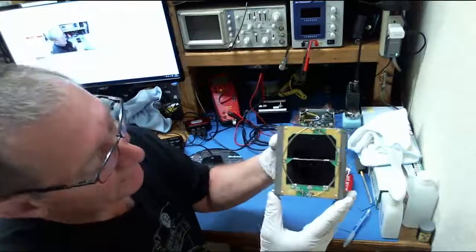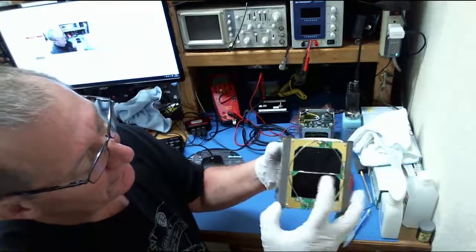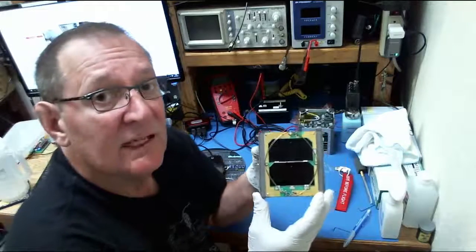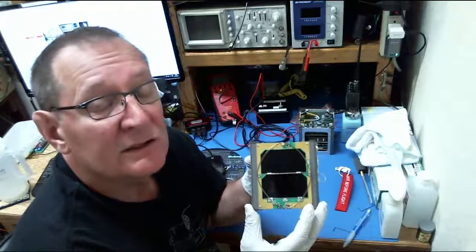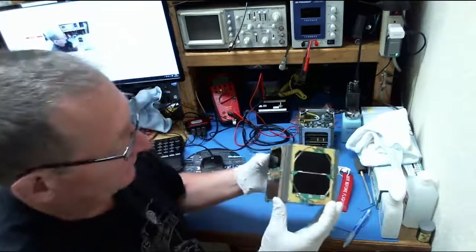from the minus Z side of the satellite. You'll note that the way the antenna is coiled up, we have an insulator here, here, and here, but we have a conductive standoff up at the top there. The conductive standoff is there in order for us to know that the antenna is stowed. When the antenna is shorted, or touching that, it causes a short to ground. The IHU sees that as an indication that the antenna is stowed.